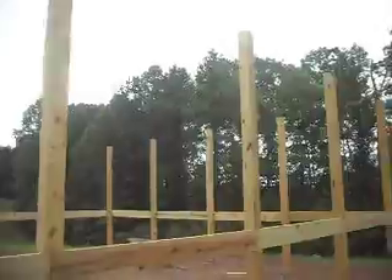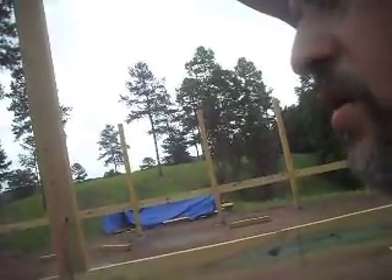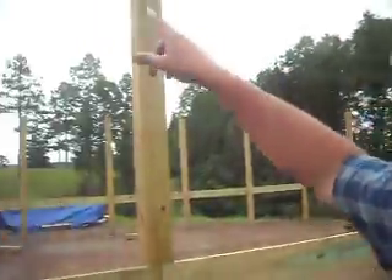Now I'm going to be setting six-by-six beams that connect all the way across — they'll wrap around the house and sit on top. I call the vertical ones posts and the horizontal ones beams, but they're all six-by-sixes and all 16 feet long. I'm here alone so I'll have to figure out how to do that by myself and I'll probably make a video for that. So step three is setting your posts and beams and getting them in concrete.